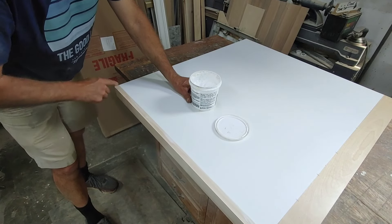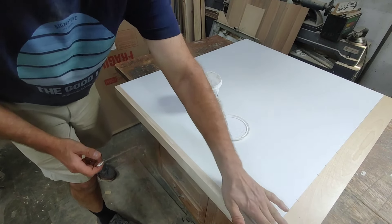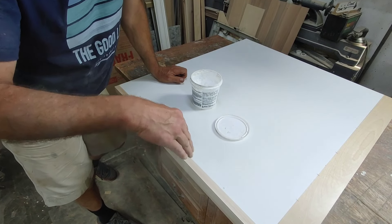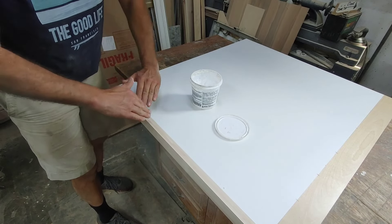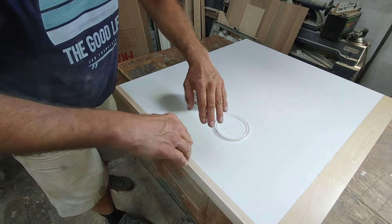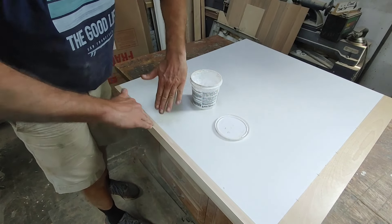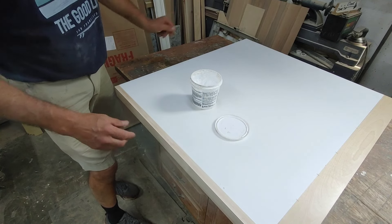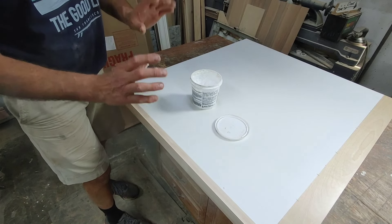You're not trying to fill it in so much as you're trying to create a small bridge. I just push it down with my finger, and what that does is it fills the joint but not completely — so it gives you a nice reveal line all the way through that whole length. If there's any kind of dip or hole it fills it in, and when the paint goes in it goes nicely into that valley and it'll come out perfect every single time. This works on shelving or anything like this — it's actually really good for shelving.